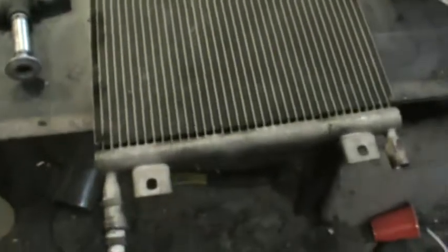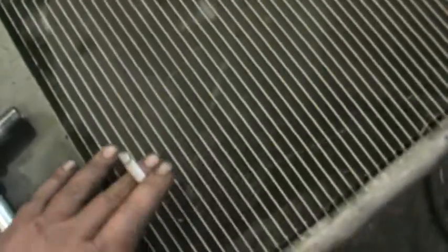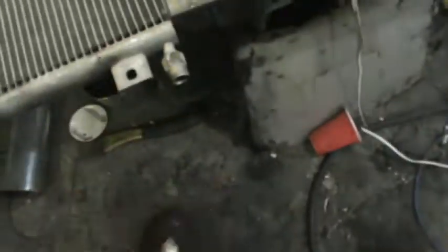What I have is this old core from my track hoe — it's off the air conditioning. It's been flushed and tested; it leaked with Freon but it didn't leak with water. The water comes in here and this type of core heats up each section in sequence, so by the time it exits, the entrance is considerably hotter than the outlet. I need to get my water even hotter. The system I have now is only about a five-degree climb in and out, but this system will have to run much hotter — almost to steam if possible.